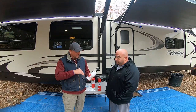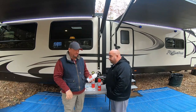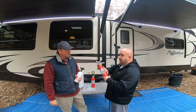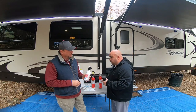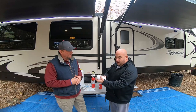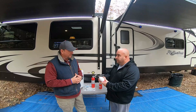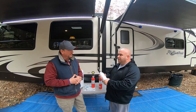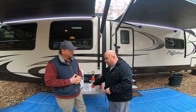Based on your experience, how long do you think you'd get out of this in terms of seconds? Approximately nine seconds for a two-and-a-half pound fire extinguisher. This smaller one is probably about a pound — I would imagine it gives you five or six seconds. Which doesn't seem like a long time, but when you're putting a fire out, it does its job.